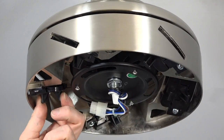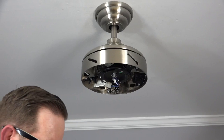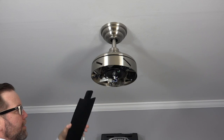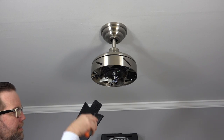This ceiling fan features a patented QuickInstall blade system. The clip inside the motor housing locks the fan blades in place. The notches on the end of the fan blade insert into the fan motor housing and are locked in place using the patented clip. For proper installation, make sure the side of the fan blade marked "this side up" is facing towards the ceiling.